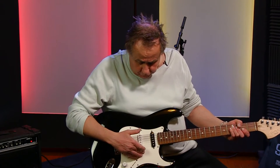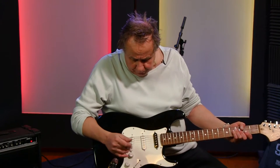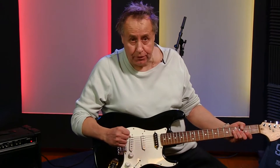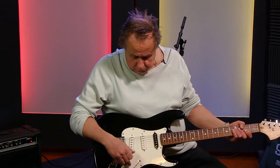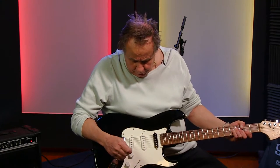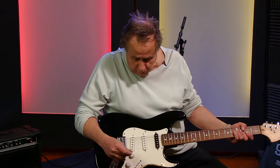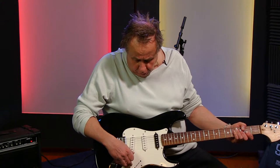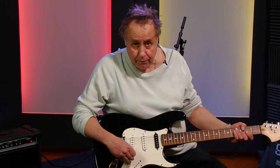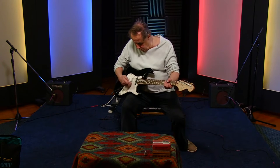One of the things I did with this guitar in particular was to remove the five-way switch and reconfigure the way I hook these pickups up, where these two white ones are to the two tone controls that are in the center here, and this black pickup is on the ring connector to the stereo output, so that these two are in parallel, and you can blend how much of each pickup you want to hear. In other words, you can turn one all the way down, and the center pickup will still be on.